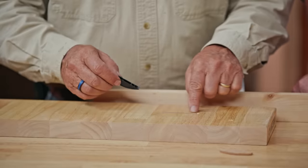Let's go ahead and put it in. Not going anywhere unless you pull it off — you want it to. Now we have a nice flat surface again. We've mounted this aluminum track right on top of the fence right here. In the top of this metal channel there's a recess that we can attach this tape into — it will sit flush with the top edges of the groove. We have to line it up with the saw to calibrate where it needs to go. Then we have this piece that will mount on top of the track, slide back and forth to any measurement we want. We stop it, lock it in, put our pieces right up against it, and every piece will be exact every time we cut it.